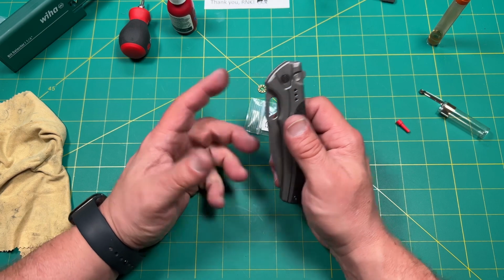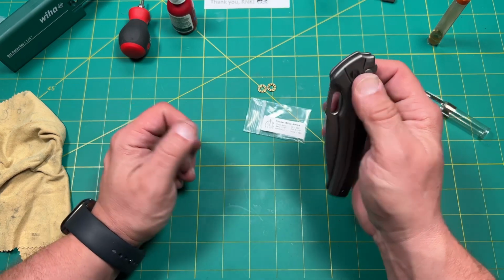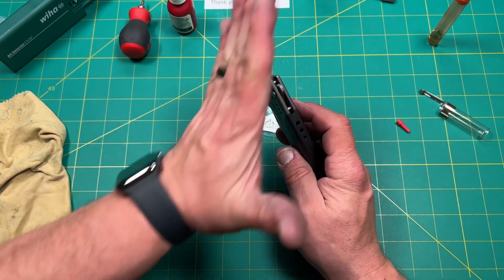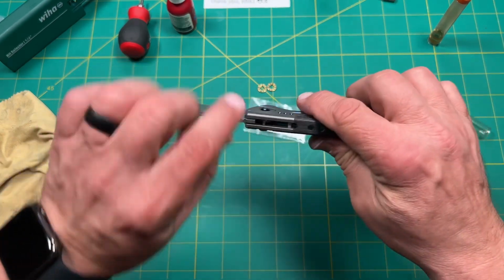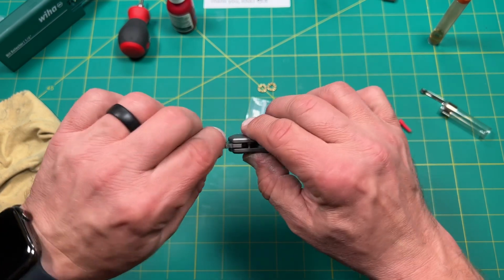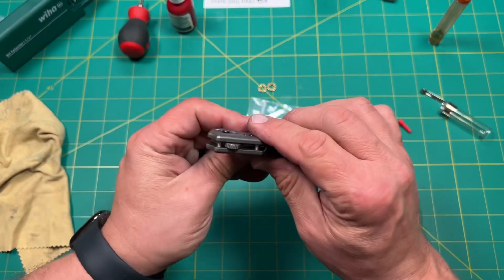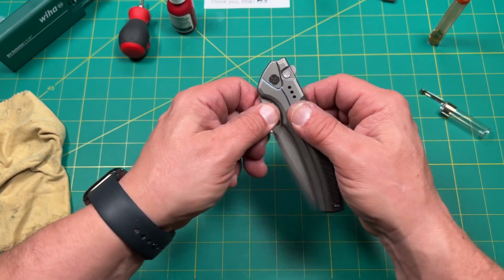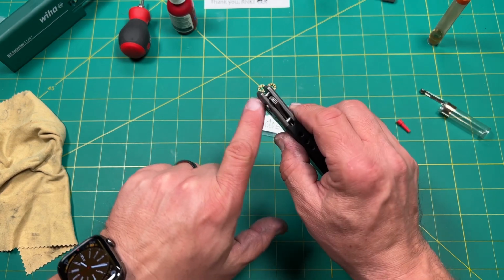What's the right term? I would say plunge resistance, or, technically, there's a hole there. The plunge lock is sort of engaging it, but it's at a very level angle. It's overcoming that angle. When it's engaged over here, it's fully engaged into the tang. It's not going to move unless we move that off the tang of the blade, and that's what unlocks it. But that's also what locks it when it's there with a spring pushing up on it. Likewise over here, it's being held in place, but you can break that part because of that angle on the blade itself and where the plunge is holding it in place.